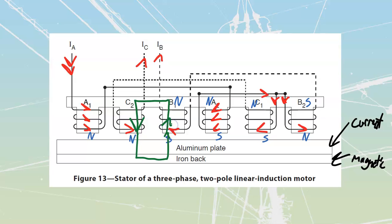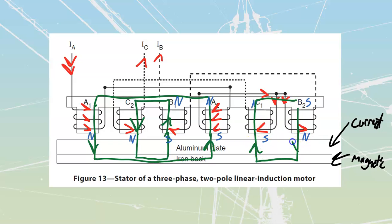As far as our magnetic lines of force are concerned, they are going to go from north over to south. They're going to shoot straight across because they want to hit that magnetism of the iron back that we have over there, then re-enter our south and run through the stator. So we have lines of force that look like that, including lines hitting the stator and going back through — and everywhere that we have this piercing of the aluminum by these magnetic lines, we have everything we need to set up values of voltage.